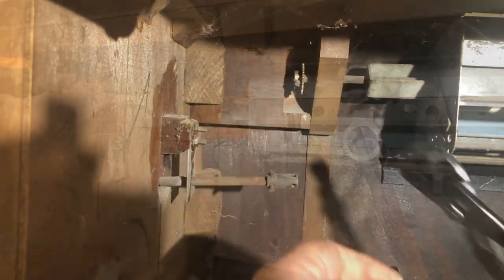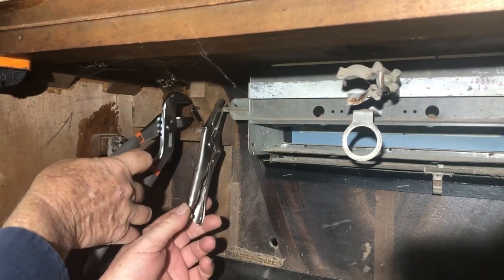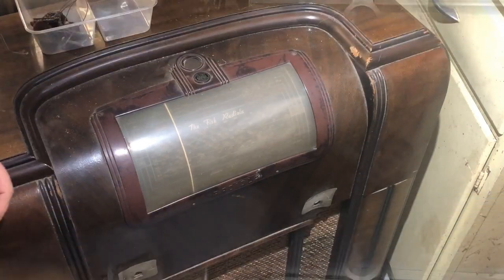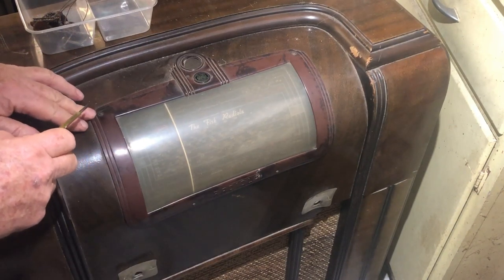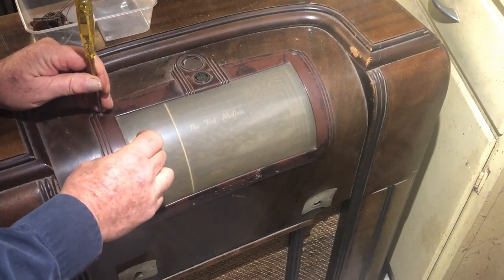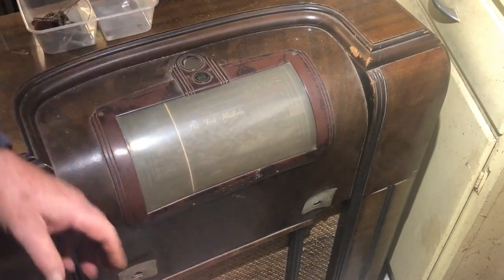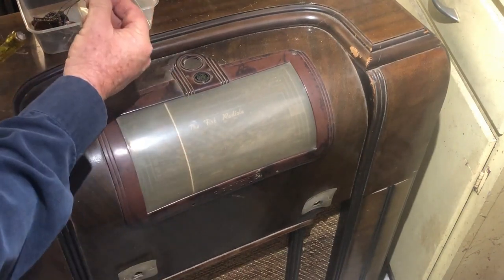These are tough to get off - some of them are really hard. That mechanism certainly fought me all the way. The rest of it is held in by screws which seem to go right through this Bakelite plate and into the steel mechanism underneath, so I'll have to take those out. This Bakelite fascia looks as if it will be quite fragile when it's taken out - it looks very thin. One of the major challenges I think will be to replicate this glass here - it's gone quite cloudy and I don't think I can reuse it. I might be able to get some perspex and bend it to the right radius.